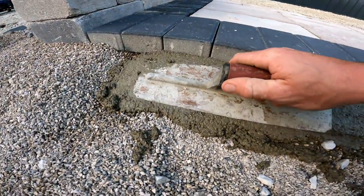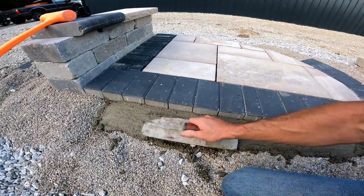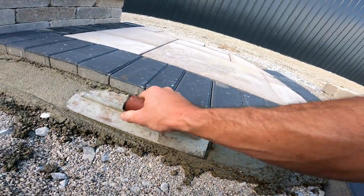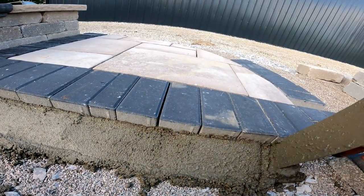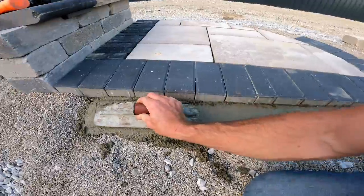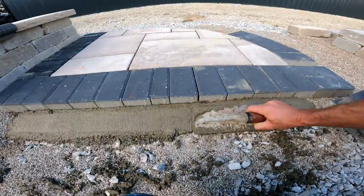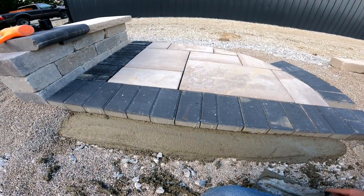It doesn't have to be a fancy finish. We're coming up about a third of the way up the paver — you can go higher, but the more you do, the less dirt you'll have covering things. It's easy to want to put a lot of concrete in, but that area right there is probably really plenty — totally adequate. We'll finish it down nice. This cheap mix shows a lot of sand through it, so don't use this stuff for any actual finished concrete project.